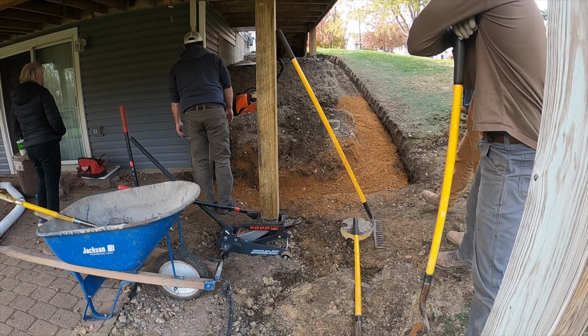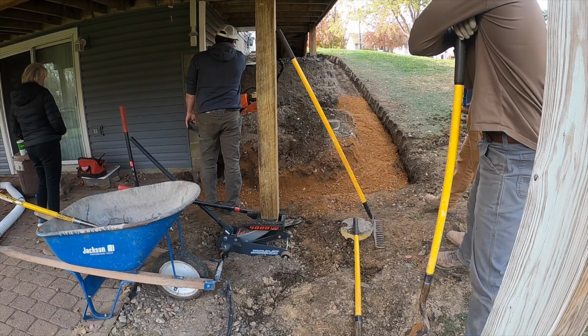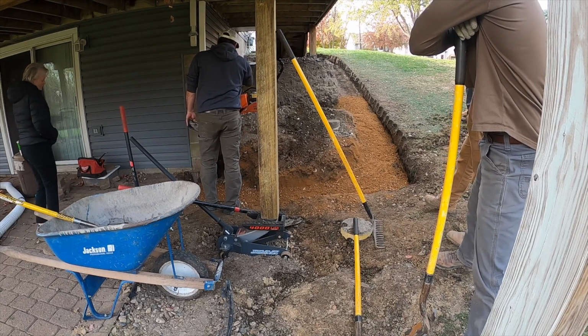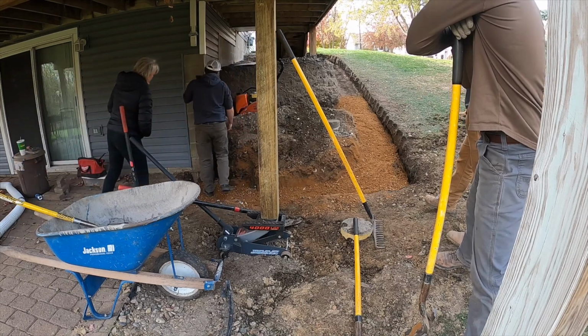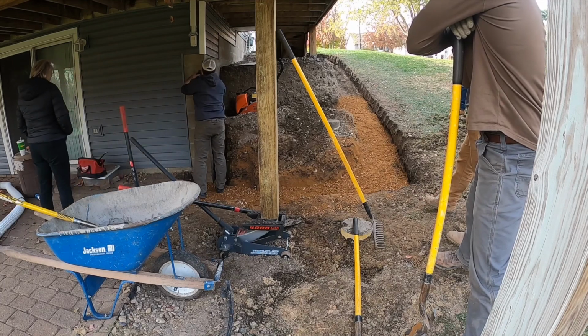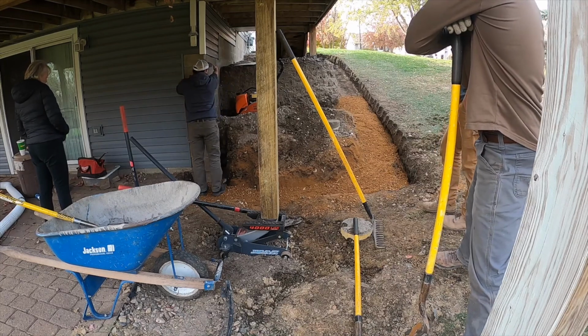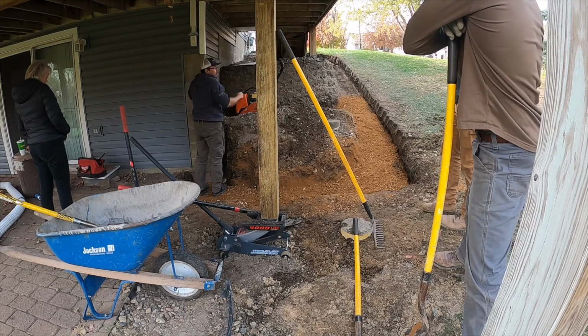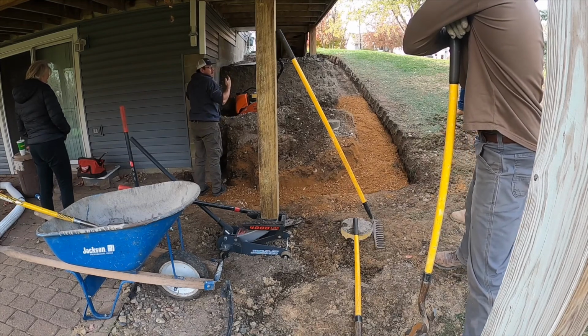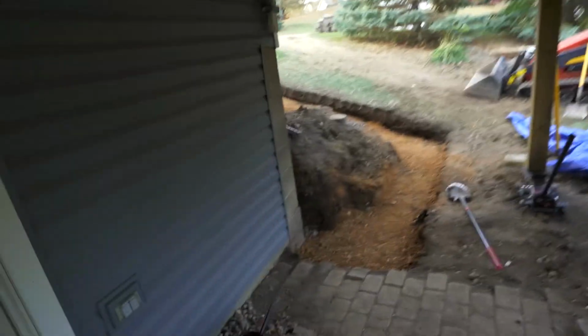I don't think this is a settlement issue. The weight of this wall right here looks to be pushing in. Where these 2 cracks are, those cracks exist. This water weight is shoving this block in right here. And this is being pushed out because this block is shoving this block out. It's rotating. So the water weight, or the hydrostatic pressure that's happening right here, is pushing your wall in. And because there's 2 cracks right here, it's been separating those cracks. Those cracks were potentially due to settlement, but now you have the wall being pushed in, and it's forcing this block to rotate out.